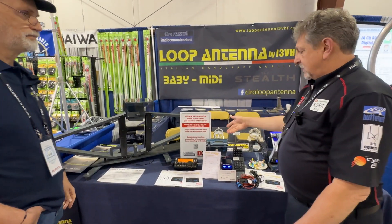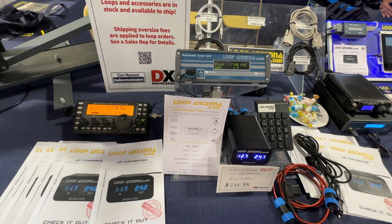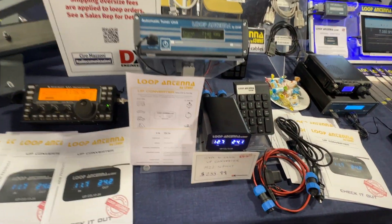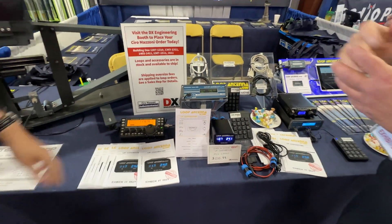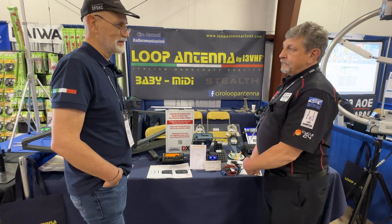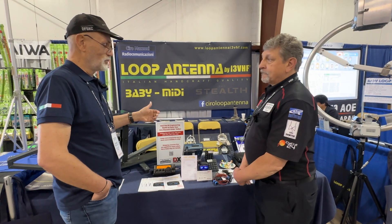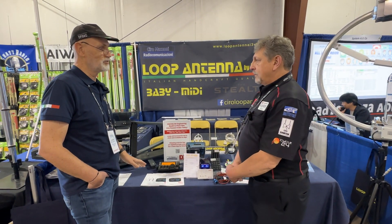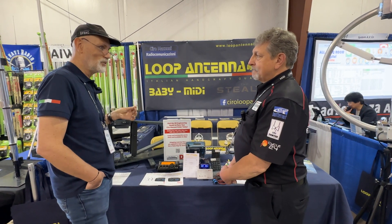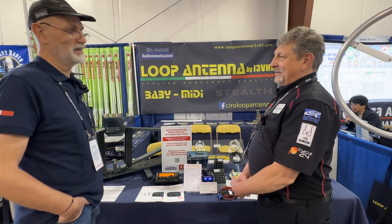All of these loop antennas are run by the ATU 2.0. The beauty of this unit is that it sends a signal out to each of the antennas like an analyzer, and then it tells the loop motor where to go to get the right tuning for the frequency. It's incredibly fast — if you make a QSY from the 40 meter to 10 meter band, it's done in 10 seconds. When you stay within a band and you are just moving within a band, it's a question of one second or less. Pulsing the signal to the antenna, measuring the SWR, adjusting with the motor — continuously in less than a second.